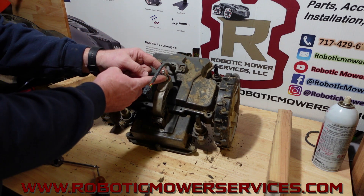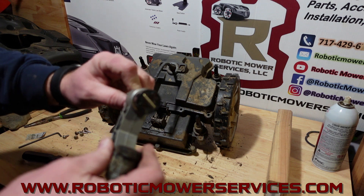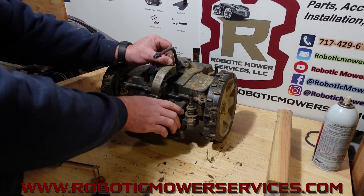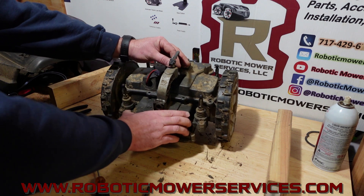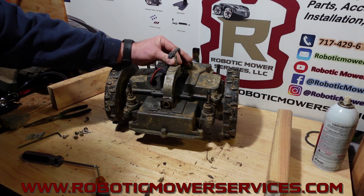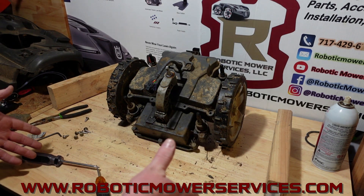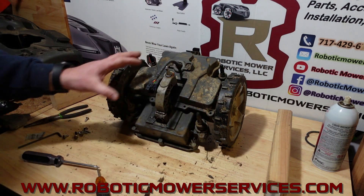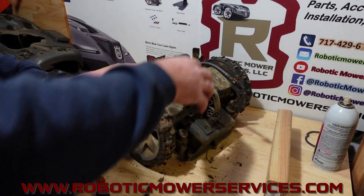This shaft is going to be fastened into the spine of the mower, so it moves with the front of the mower. Any time the front of the mower moves, your magnet's going to move. Any time the back end of the mower moves, the sensor board is moving — not the magnet. That's how it's going to know that the back end is 15 degrees off from the front, or the front is going around a corner and 35 degrees off. If you take all this apart you're going to have to put it back together and then use the AutoCheck program to recalibrate all of this, to make sure everything is saying yes, we are in line — otherwise the back end and front could end up fighting each other and going around in circles.